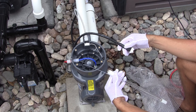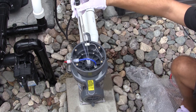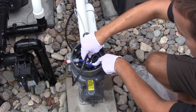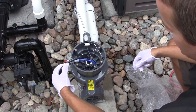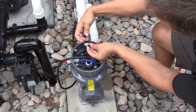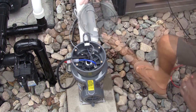Do not touch the UV lamp with your bare hands. Gloves are included with Hydro Right and must be used when handling the lamp. There is a single ballast cable from the controller that connects to the UV lamp, packaged separately. This cable must be connected to the lamp before inserting the lamp into the vessel. The lamp has been designed to only fit one way — there are tabs on the lamp that need to be lined up for insertion. After fully seating the lamp into the vessel, twist the lamp and cable clockwise about one-eighth turn to lock it into place. Insert the UV lamp's ozone tube into the back of the ozone manifold as shown, and route the ballast cable through the appropriate cutout.